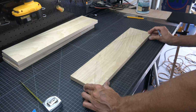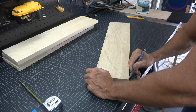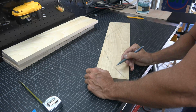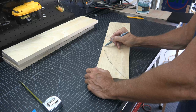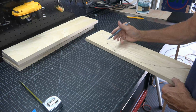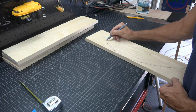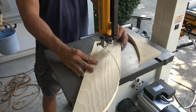Measure down to your line. Do that on the exact opposite side using those measurements. They won't be too far off, but once marked, you can see how much more of your bend is needed to ensure they match perfectly. I got pretty lucky, and mine was only about 1/8 of an inch off. Not really noticeable to the naked eye, but you can make the correction now.